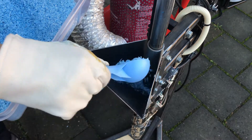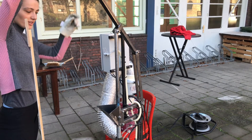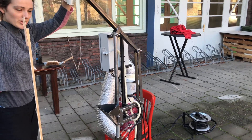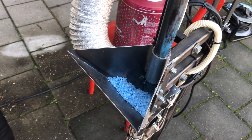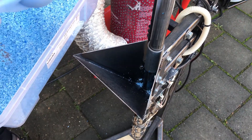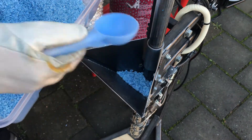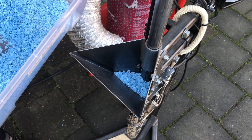Now that we have set up the machine we will start feeding plastic into the hopper. When the barrel is full you can lower the lever to push the plastic down. You can use a tool to move it in there. Repeat this step until you've put enough plastic in the barrel. When you're done with this step you can put the filter tube back onto the hopper.